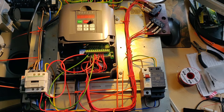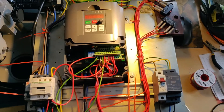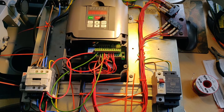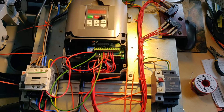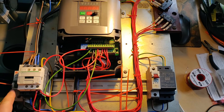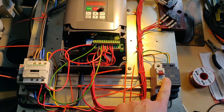Hello, I thought I'd shoot this video just to describe the problems I'm having with a VFD that I'm wiring in for a lathe. This is a Huan Yang four kilowatt VFD and I'm trying to wire it in with as few extra components as possible. I've got an incoming contactor, circuit breaker, a 24 volt DC power supply and an MCB for that as well.